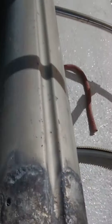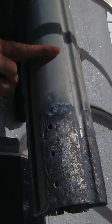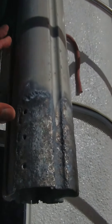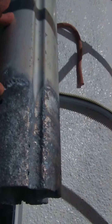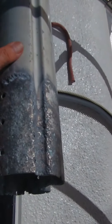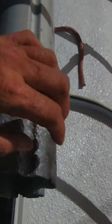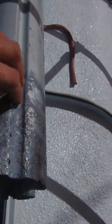So I get up in there. I'm going about as far back with the glass as almost twice the distance to the screw holes from the end — getting a good three or four inches of coverage on the inside, basically making a shell two to three layers deep. Then I come back out and put one layer on the outside and two layers in the groove. That's basically the repair.